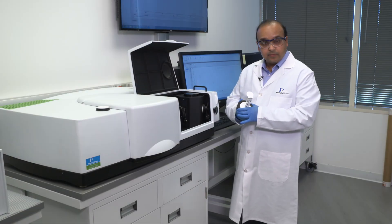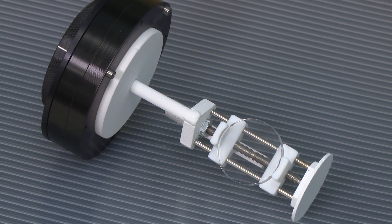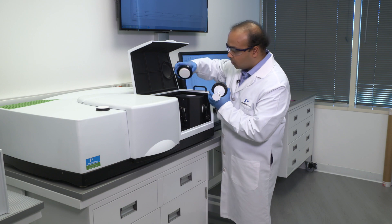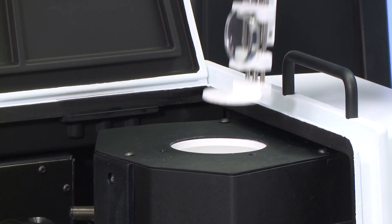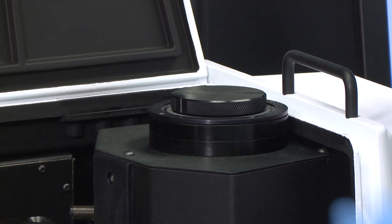It is also possible to make measurements inside the integrating sphere. Here is what we call a center mount accessory with a sample mounted on it — a jaw-style accessory that helps clamp the sample between the two jaws. To make a measurement, we remove the top part of the sphere and drop the center mount accessory right inside the sphere. A couple of nuts here will help lock it in place.